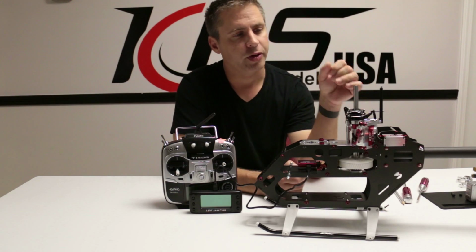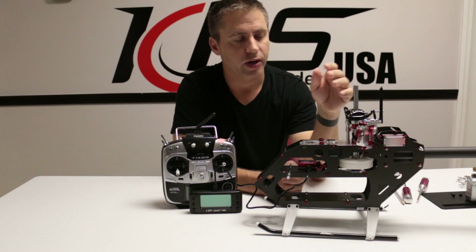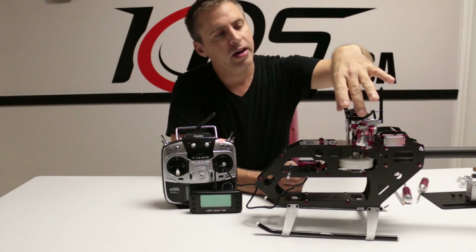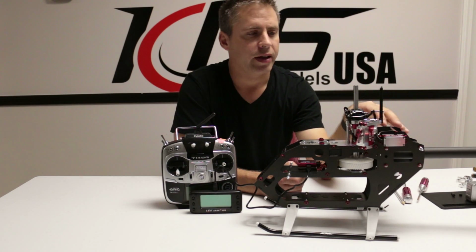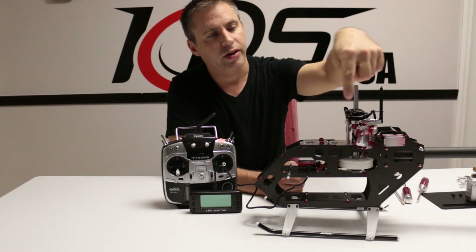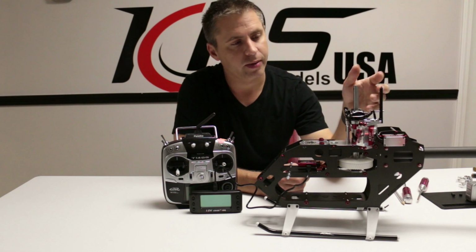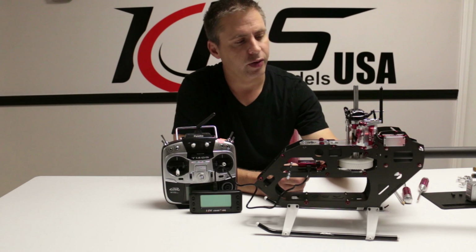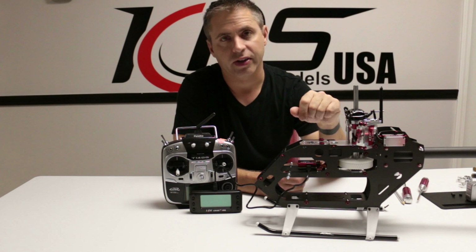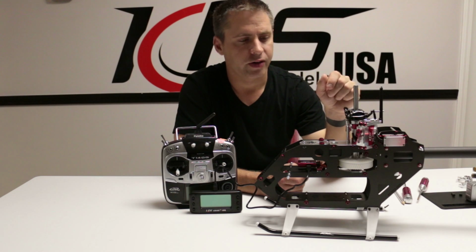On this helicopter we have what's called an HR3 swash plate. You can look in the Ebar menu and determine what type of swash you have. HR3 is one servo behind the main shaft and two in front in a 120-degree radius. In that configuration our servos are numbered: number 1 in the back, then going clockwise 2 and 3. The Ebar has servo 1, 2, 3, 4 ports. They plug in correspondingly. The tail servo is servo 4. I recommend leaving that unplugged until you've gone into the Ebar and set the proper values for your tail servo as far as frequency, hertz, etc.